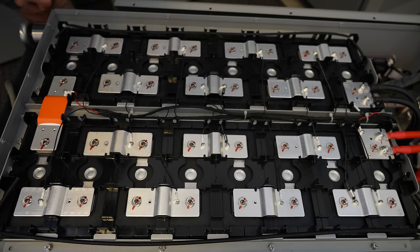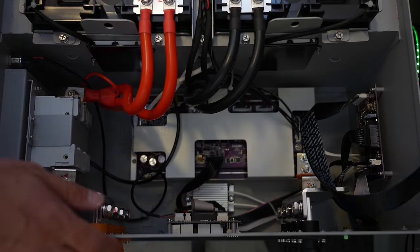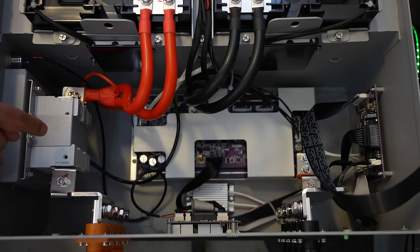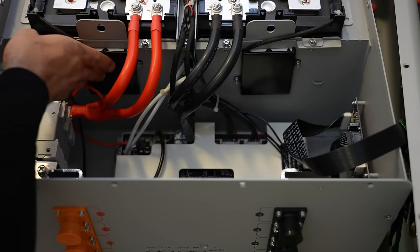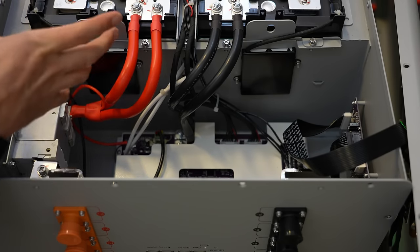The overall build quality is very similar to most server rack batteries, so nothing really special there. The heaters aren't immediately visible, so let's look around closer. But this is actually pretty special — look at how big these bus bars are and how they connect to the circuit breaker. This is rated for DC so it's massive. The Amphenol connector connection to it is very solid.